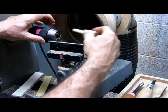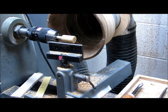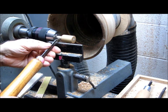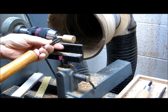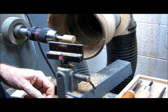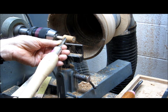To complete the cork, I'm going to take the cork and insert it into a keyless drill chuck, leaving about three-quarters to half an inch sticking out beyond the chuck. The first step is to square off the end. Then I'm going to use the 1/8 inch parting tool to shorten it a little bit, and make sure that I undercut the base of it a little bit so that the cork will fit properly when it goes into the bottle stopper. Then I'll take the spindle gouge and just slightly taper the cork.